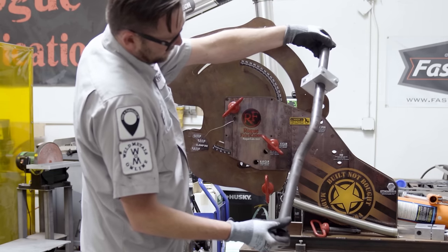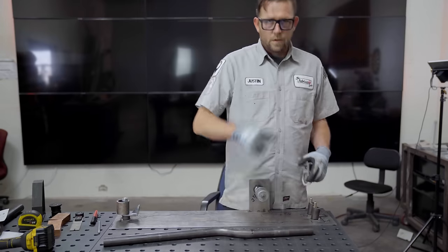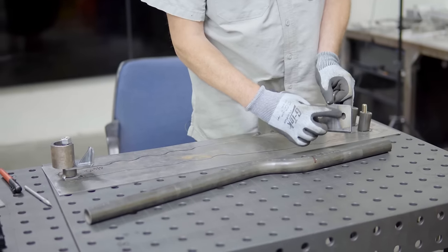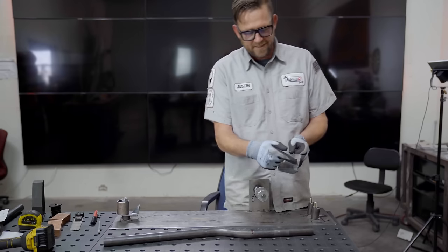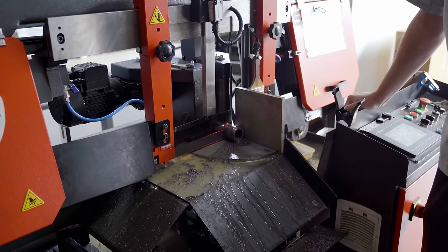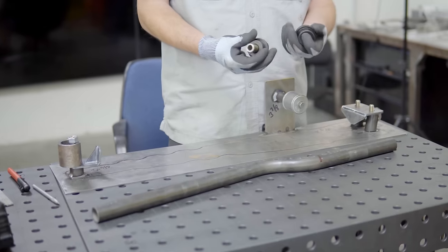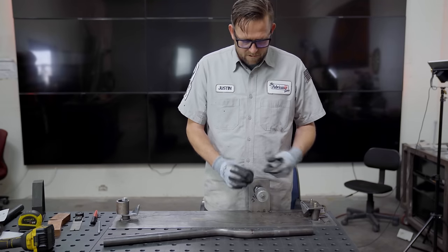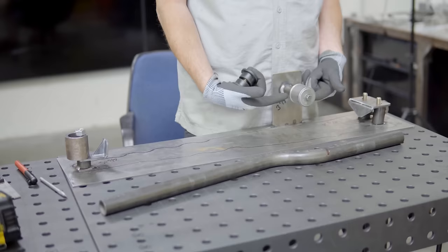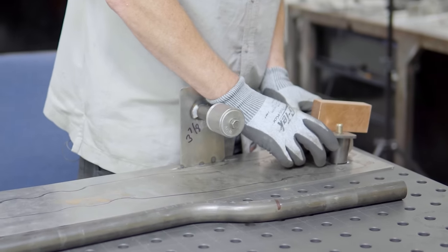Not a bad looking deal right there. I'll take it. Now we'll run over to our fixture and see if this one actually fits. These are the pieces we finished welding earlier. Each one does have a little bit of a slot for some movement — designed like this to have just a little extra play in the chassis itself. This piece here is a bushing housing — I just cut this off at the saw. It's a two-inch quarter-wall DOM, a universal size for universal bushings. We're not going to tack anything up with the actual bushings in here because they're polyurethane. On the other side of this washer I do have a dummy bushing that I machined many years ago. I'll just set that copper there on top so it can sit kind of freely.